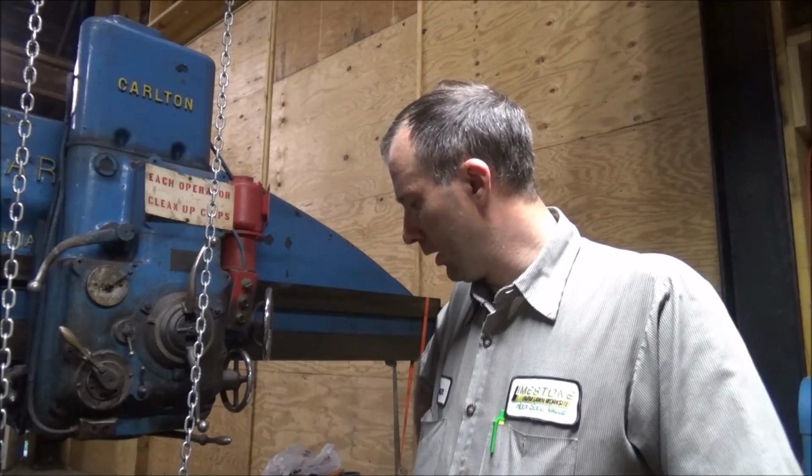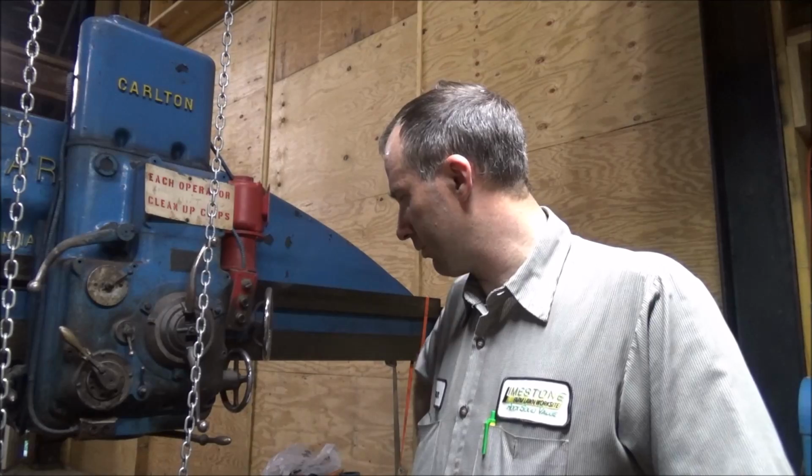So ripping it out of the parent material has always been the case until this last time with this test with doing it DC straight with no flux and just really lighting it up hard. And then, like I say, it's melted, fused, mixed. It's a cluster in the weld material, but seems to work okay. So I said, hopefully I get to try some other stuff and figure out maybe the best method of attack before I try and weld up this drill piece. And might wind up with a really good result without doing any of the stuff that anybody said needed to be done to get it done.